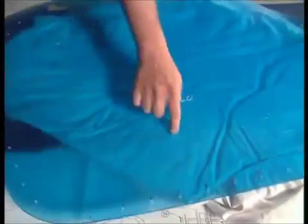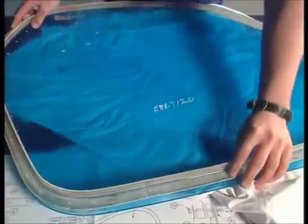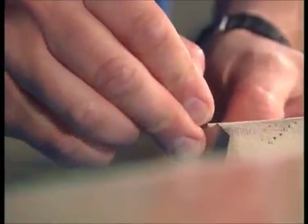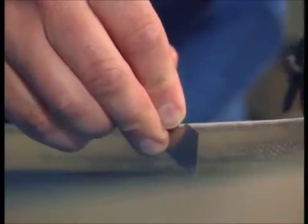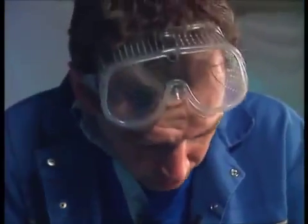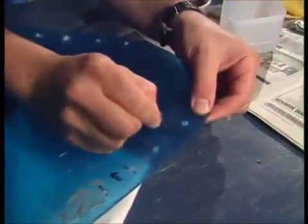A whole load of drilling. So, one plexiglass and one frame, all drilled to match. I'm just running a blade along the inner edge of the window frame to cut through the plastic protective covering over the plexiglass, because I need to apply a resin to bond the frame to the plexiglass.